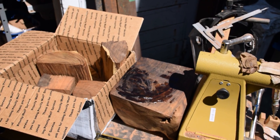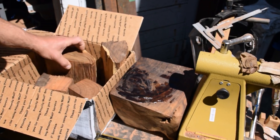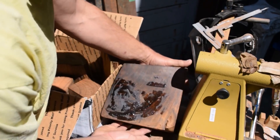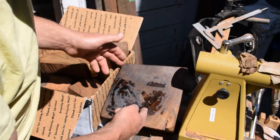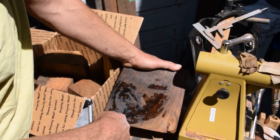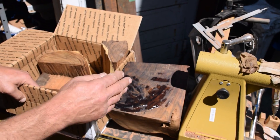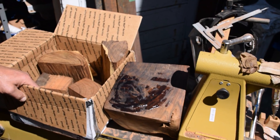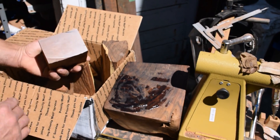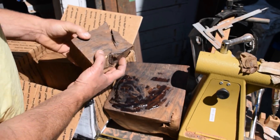When I got home from work Thursday, this package was here from Clyde. He sent this ironwood to me from Kansas — it is desert ironwood. There's a pretty good size ring shake right here, maybe about six inches out from where the pith used to be on this piece. This piece of ironwood experienced something that gave it a pretty good ring shake. I'm trying to stabilize that and as I turn it away I'll see how much penetration I got with my epoxy — it is a thin penetrating epoxy so it should get in there and hopefully seal up.